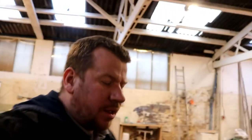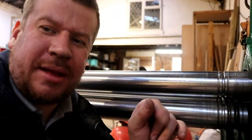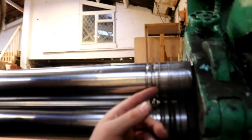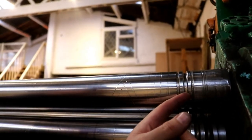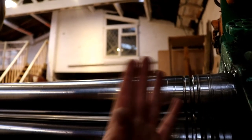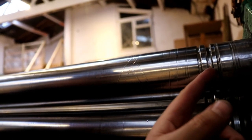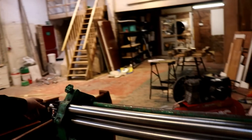Froggie's had to go home. Thanks again mate for another fantastic pair of hands. The man is not only useful but knowledgeable — he knows a heck of a lot about engineering. What we did together: the flat bar kept flipping all the time in the rollers as we were trying to roll them into rings. So what we did was grind out the rollers — where the ring rollers are, we added one which was U-shaped with sharp edges so it actually held the flat stock 5-6mm wide. Stopped it from flipping over, and we tightened up a bit of slop in the gearing.